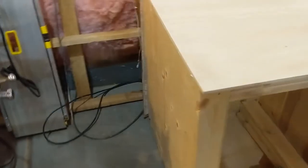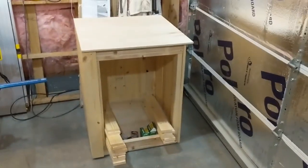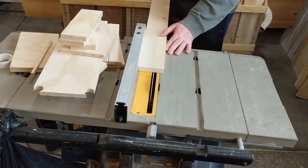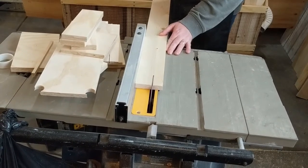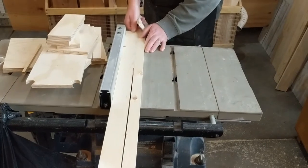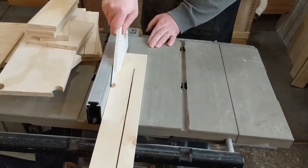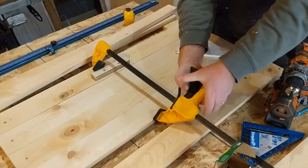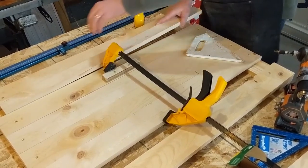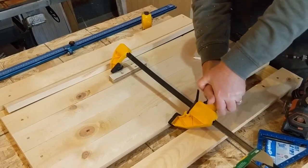Now that our sides are on and our top lid, we kind of have a semi looking box. Let's go ahead and start putting together our front panel. We're going to have to rip a couple of boards here just to get the right length of that front panel. We're very careful using a table saw, especially a table saw like this. These boards were pretty warped so we use this clamp jig here to force those boards into place on our front door. This is very easy to do — just get a scrap piece of wood and screw it in, and one of these one-handed clamps is great for getting this lined up.